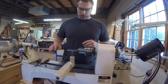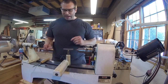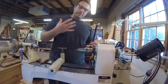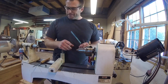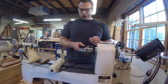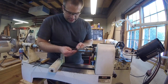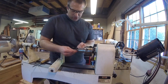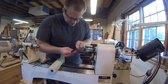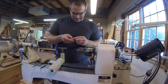Some people like to try to part things off and catch them in their hand, but that's pretty tough with the size of this little guy. What I do is take a hacksaw blade and finish it off with the lathe off. Some people do it with the lathe on — I just prefer to do it this way. There's also a couple of other choices: because there's a little hole in the middle of the finial cap, you can leave a little bit of the center piece to fit down in there, or you can take it right off. It'll work either way, so long as the piece left isn't too thick for that hole. So I give it a little cut and twist — and there it goes flying, just like I didn't want it to.